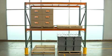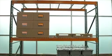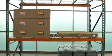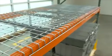Edge loading is the most economical way to store pallets, as the pallet itself serves as the shelf. Deck loading is suggested when the pallet does not rest safely on the top of the beams without accessories. This is preferred in cases of varying pallet depths or the condition of the pallets being used in your system. For deck loading, skid supports, crossbars and wire decking may be required.